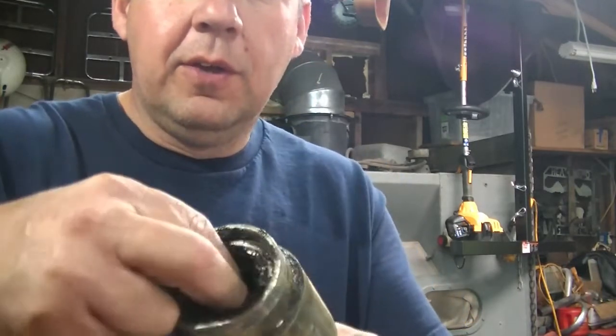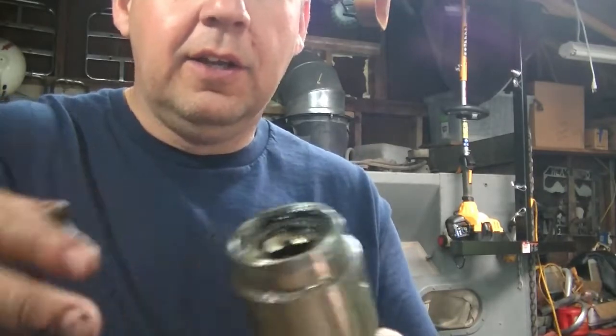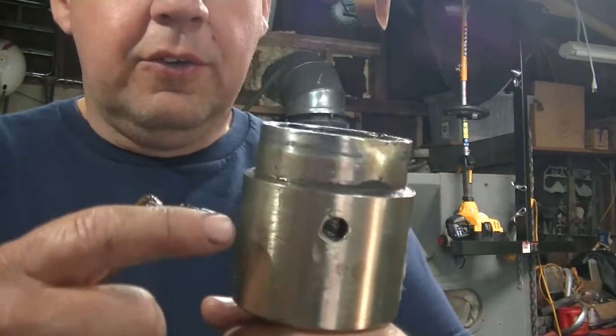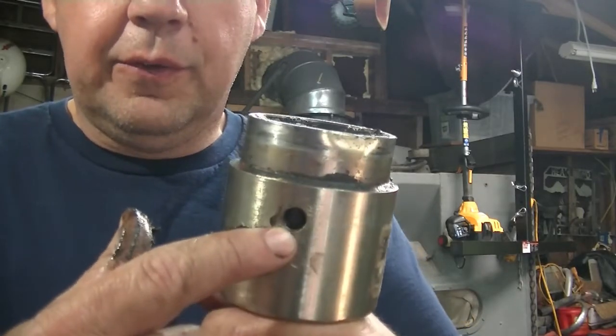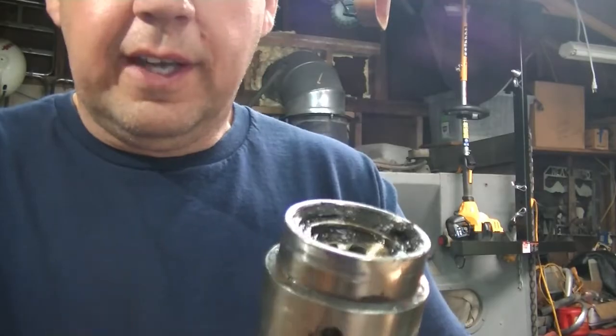The inside spins one direction but not the other. So what happens if you don't have this — that brush hog will start pushing the tractor, maybe break some stuff, maybe push you into somewhere where you don't want to be. So it's absolutely necessary to put this on. There's just a pin that goes all the way through, through the existing PTO shaft, and then a grease zerk on each side.